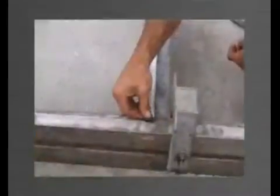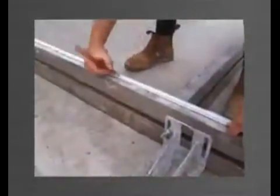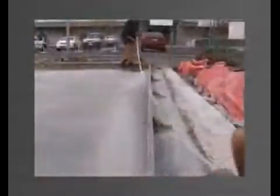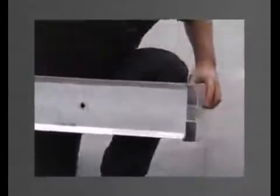The edge form includes top and bottom 45-degree edge fillets and a continuous groove which depicts the actual face edge of the edge form. This allows you to measure from this groove when measuring panel size and cast-in locations such as ferrules and lifters, without having to offset for the 15mm fillet. One end of each length is cut as a splay, allowing that end to fit into the face of another edge form, forming a neat and sealed corner. The other end is left square.